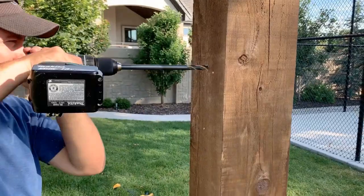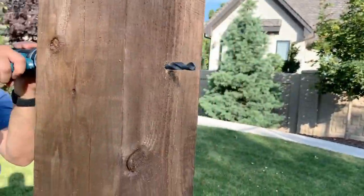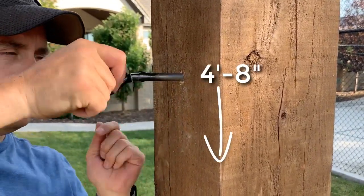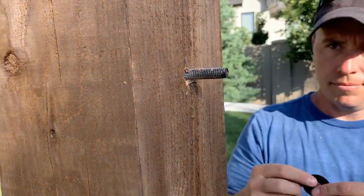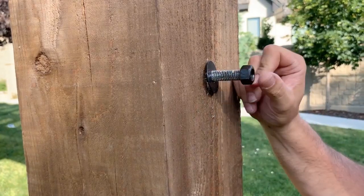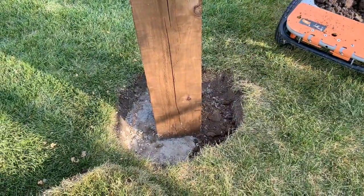One of the last things we're going to do is drill a hole for what's called a lag eye bolt — this is the hook that's going to hold up your hammock. I drilled mine at about 4 feet 8 inches off the ground. Go ahead and stick the lag eye screw in — this one is a 10-inch lag eye screw. Put the nut on the back, tighten it down nice and tight, and then you're ready to hook up your hammock.